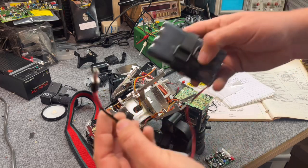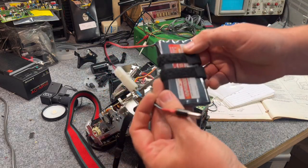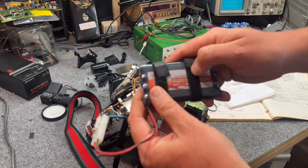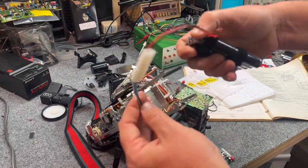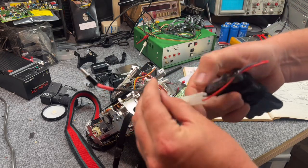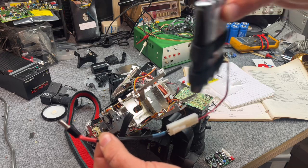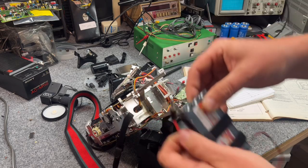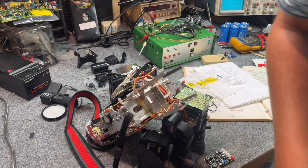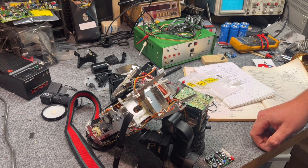If you can't buy a battery pack — this is actually something from high school — you can get a 9.6-volt RC car battery, some velcro, and make a little adapter from Radio Shack parts. I had velcro on the back of the Beta movie, stuck the battery on there, plugged it into the DC jack, and that's how I used to record. Now I'm rebuilding the battery packs, but back then I didn't have the skill yet.